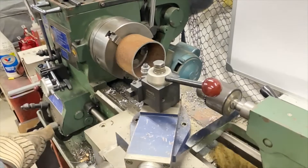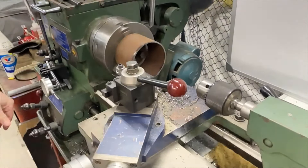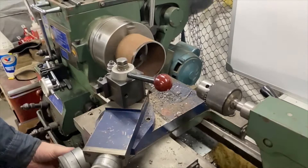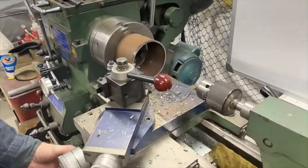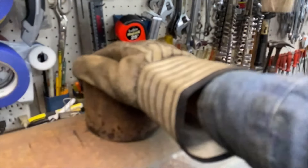I decided we need at least one good side on this thing because I don't know how good the back side is, so I'm going to do my best to true it up on the lathe. Just very gently come up against this and start picking off some material. Now we have a complete trace line all the way around. I can see that pencil mark — it has a rainbow shape, then goes nearly to full length, and back to rainbow shape. I'll take the angle grinder and chew away a lot of that and then fine it down with the flapper wheel.